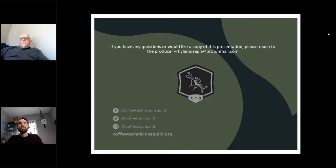Keegan, what about you? Yeah, so definitely starting with the basics, the difference between AC and DC, Ohm's law, all of that stuff. But when it comes time to actually look at a schematic, what I really like to do is get the schematic out and lay it down next to the machine, bring out the multimeter, and just walk through and show, generally with continuity, okay, look, these two components connect here, let's meter it, and we can prove that connection right there. And even if the wire goes into the loom and disappears and runs through the frame, you can illustrate really cleanly point A to point B to point C, all the way through.